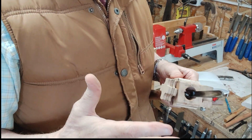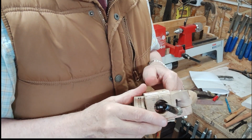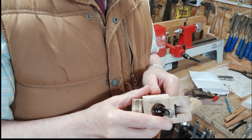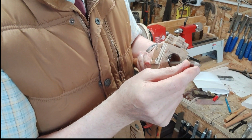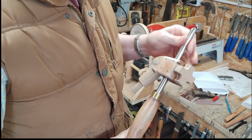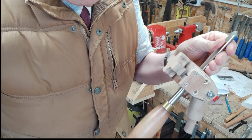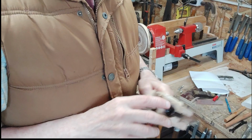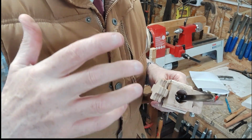And that happens throughout, and it's up to you to decide which bevels and which sweeps are convenient for you to use. Different sweeps and different bevel angles produce a different efficiency in cutting, and it's amazing, because of the length of the tool, that angle can be quite critical. If you get the angle wrong, you could end up with the handle hitting the bed of the lathe as you're doing bowl turning. It's amazing how 1 or 2 degrees on that angle can affect the position of the handle at the lathe. So that's why there have been designated angles and sweeps, which I'll put up on the screen, and I'll try to indicate what those angles and sweeps are best used for.